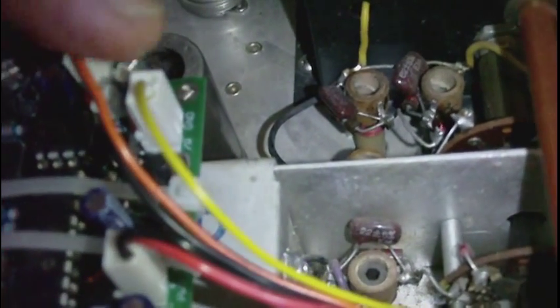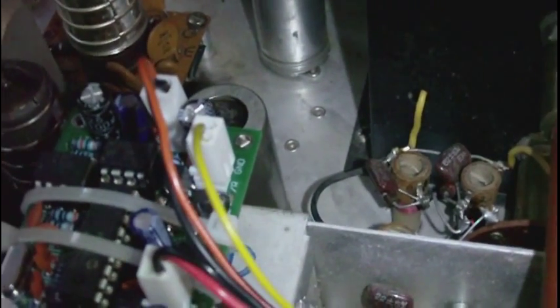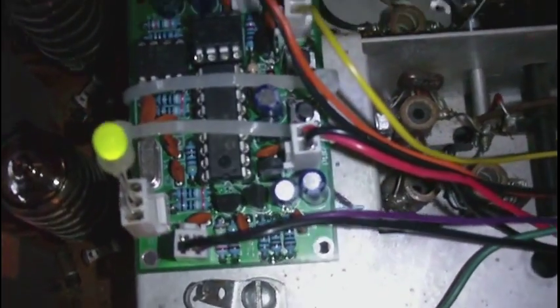The regulators look like those tiny little black transistors, and they're filtering the 12V unregulated input down to 5V and 8V. I have a transmit/receive line here that goes to ground when the rig is transmitting. The orange lead is the correction voltage — it's applying a DC voltage to a varactor diode that's in the VFO circuit inside this sealed cabinet. The circuit uses a 20 MHz quartz crystal as a reference and samples the VFO frequency to apply a correction voltage.